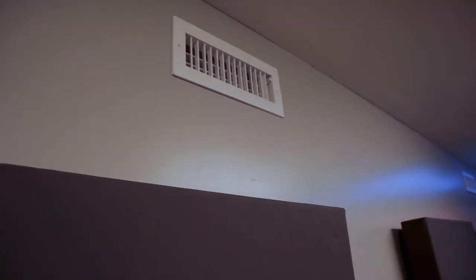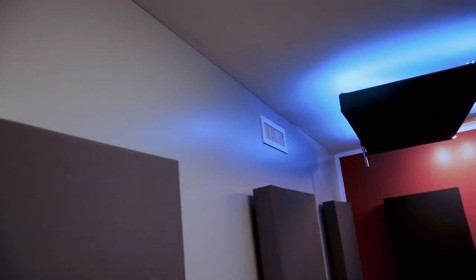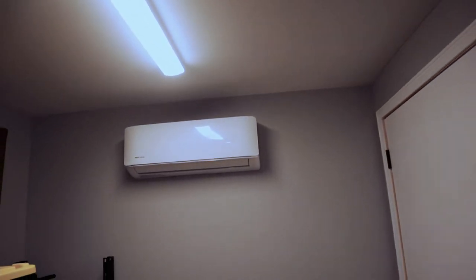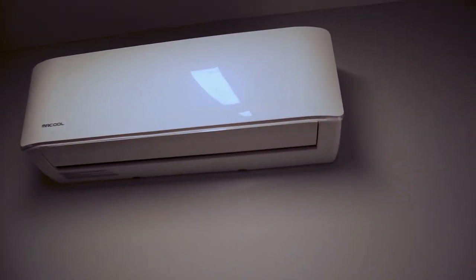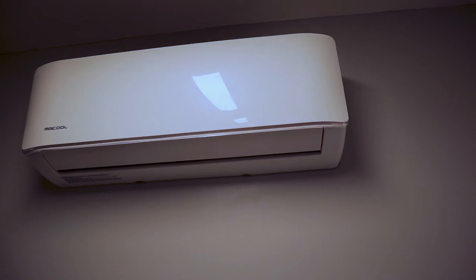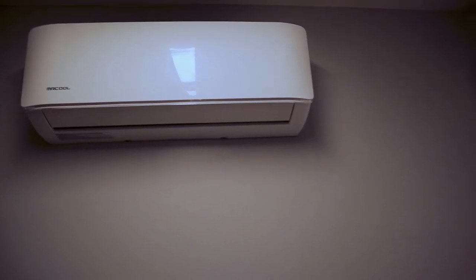So here in the drum space, the outlet for the baffle boxes is pretty small. You have these 16-inch grills at high level. I designed it so that you're exhausting from essentially the drummer area. That's where all the nasty odor comes from. And then you're supplying back over here near the other side of the room. And that also works nicely with the split system here. The way these systems work is they draw return air directly from the space above, and then they discharge via those louvers there, different patterns depending on whether it's heating or cooling, and you can obviously set those up.